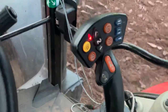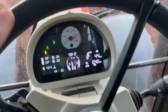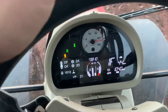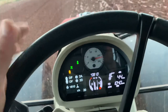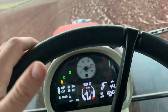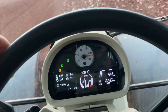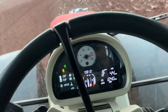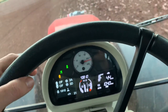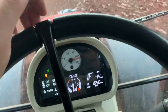Let me explain that again. Push the joystick forward, push your range change forward and hold it. You'll see it going through A, B, C and then one, two, three, four — all the ranges. Then you go A, B, C, whatever range you want it to change to in forward or reverse. It will set the pre-forward and the pre-reverse. You can sometimes set them at different ratios, but I think if I remember correctly, they both default to the same ratio.